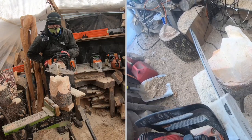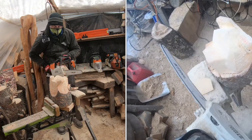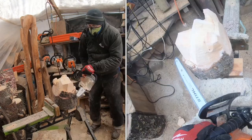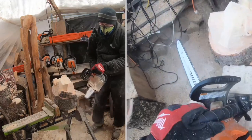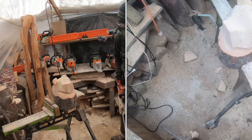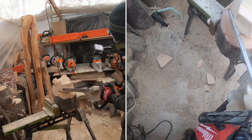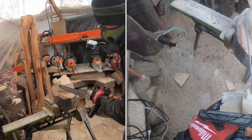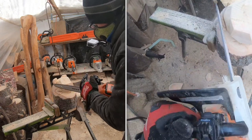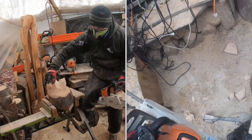Starting on one side of the bear, we lop off a little bit of the corner — not straight, you're pulling away just a little so you don't cut into that snout. Moving the saw front to back slightly can help you feel that line until you get more practice. On the length of the snout, as I cut down the bar is angled — top angled away, bottom angled in — just a slight angle cut, not a lot.